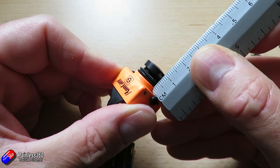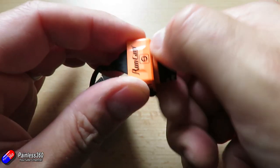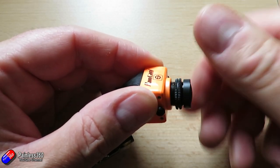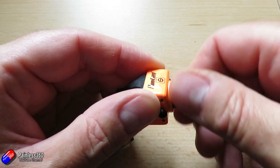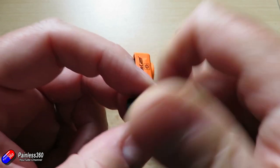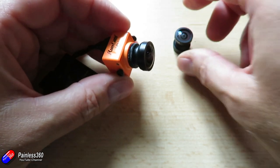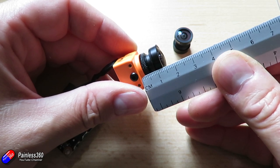To install it, it's relatively straightforward. All you have to do is undo the locking ring on the Runcam Split and then carefully unscrew the short lens that's already in there. Once that's clear, I'd recommend making sure your hands are nice and clean, you're doing this in a dust-free environment, and that you don't touch the back of the lens at all because that will mess up your image. Unscrew the locking ring and put it onto the new RC25G lens, then carefully screw that into the body. Once focused, it'll be about an extra five or six millimeters deeper than the short lens version, and it's a slightly bigger lens, so the performance will be more like what you'd expect from a GoPro style lens.